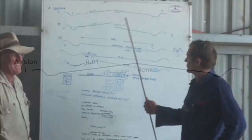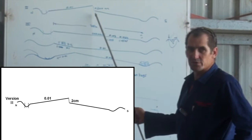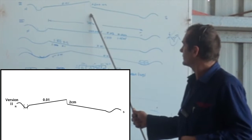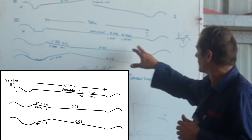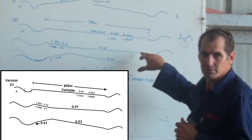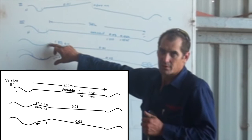Version 1 is the original. Version 2 is a step in the field, which is what Nick and I looked at this morning — whether you can actually see the step in the field as you're driving along. It does work, but it's not as good because you accumulate so much water on the far end. Field 14 has a variable grade — they vary each bay. This one's got a reverse grade, down then flattens out, so it actually fills up here, water spills over that edge — probably four or five laser buckets wide — and runs down the hill.